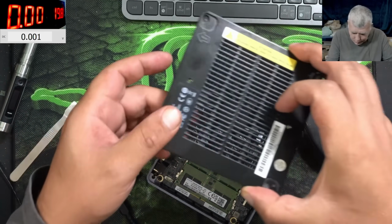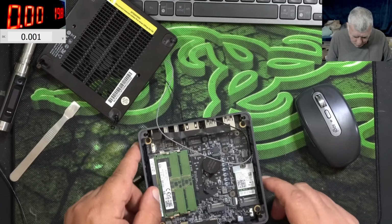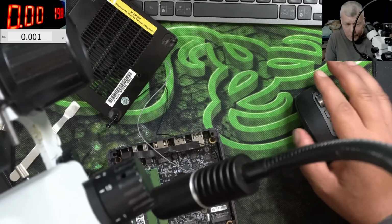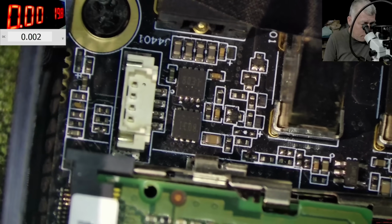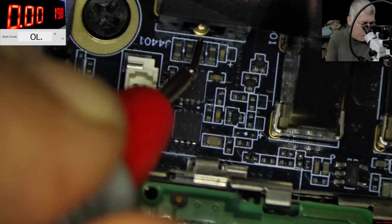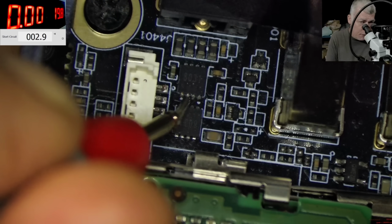And we open the, okay, we have the Wi-Fi antenna. Actually, you know what? I was wrong. Actually, there are two MOSFETs. So you have the charging port, and there you have two MOSFETs. Let's have a look under the microscope. Yeah, we have two MOSFETs. So if we are checking with a multimeter, just to understand, the charging port has no short circuit. So the short is after the first MOSFET, right? Yeah.